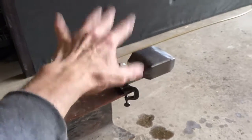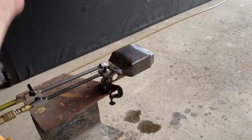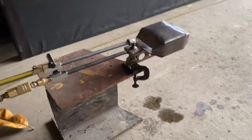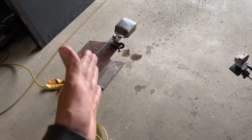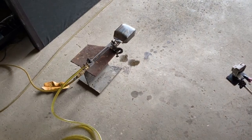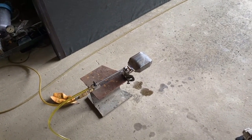At certain settings, the fuel entrainment does kind of diffuse the side flare nozzle phenomenon. But at high settings, we can clearly see the flame favors that side of the burner. So we're going to go ahead and redesign this and have another look. The fundamentals of this nozzle design are extraordinary — it's working out far better than my traditional dual nozzle setup that I would have had to build for this particular burner. I definitely like this. I might even do something that has an input duct on the bottom as well.